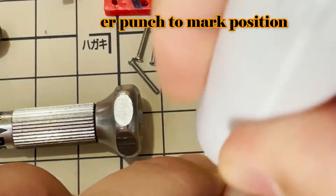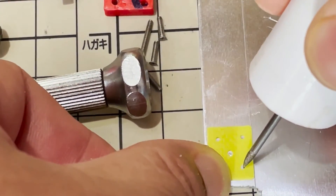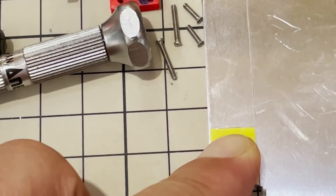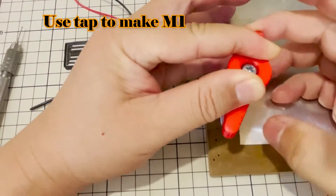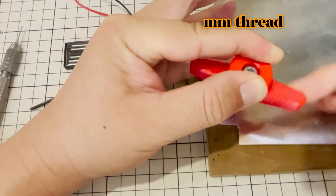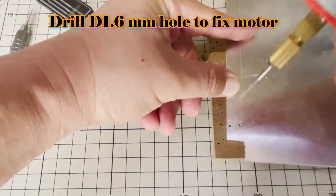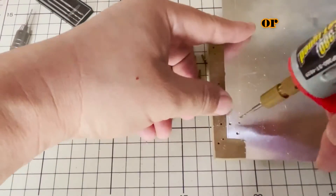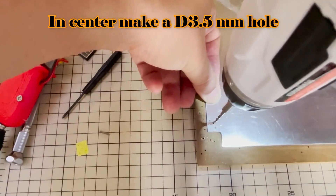I also design a small spacer to fit the shaft length. Since the gearbox is very small and has high precision, it is not so easy to fit everything in a good position. Here is a small trick to fit the motor to the gearbox: make two holes to fit the motor to the aluminum seat. The diameter is about 1.6 mm.